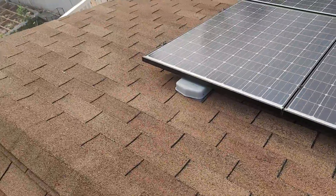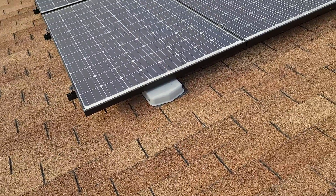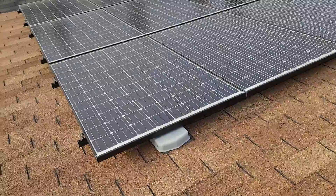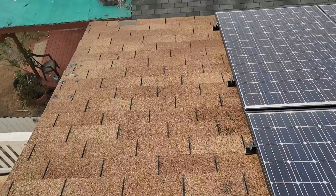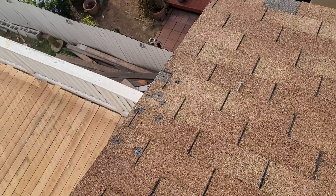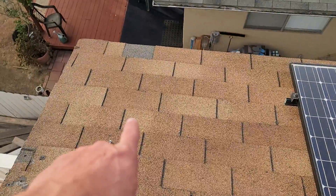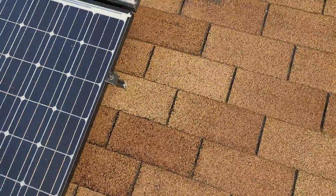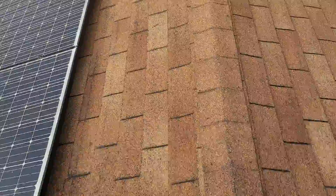I will compliment the solar installers — they did a fine, professional job on this solar install. That little thing right there is called the solar deck; that's where the wiring goes into the attic and then over to the electrical panel. It's a clean layout and I haven't found any major issues created by the solar installers. Over here we've got some satellite dishes that have been removed in the past and those are going to create slow problems over the future. One missing shingle there — not a big deal. Down near the edges of the roof the condition of those shingles is very close to what it is on the north side, and everywhere around the solar you can see wear and tear from foot traffic.